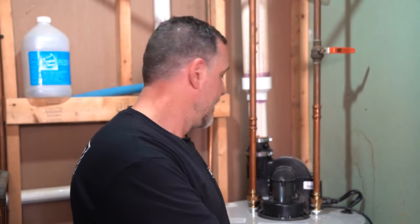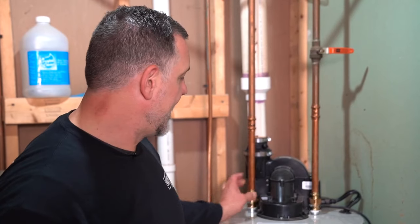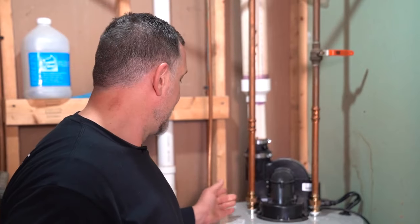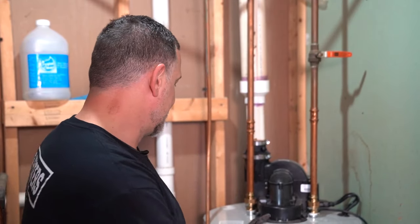This is a video on how to change out an anode rod on a Bradford White heater. Whether it's an electric heater, an atmospheric vent with a metal vent on top, or a power vent like in this case, it's the same process on all three. So if you have a standard residential Bradford White heater, I'm going to teach you how to change an anode rod. It has unions on the hot and cold so you can easily disconnect the piping — that's code in Minnesota and just a good idea to make it simple. Let's go ahead and disconnect this and I'll show you how it's done.